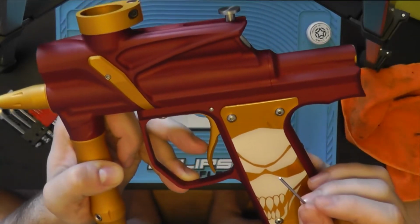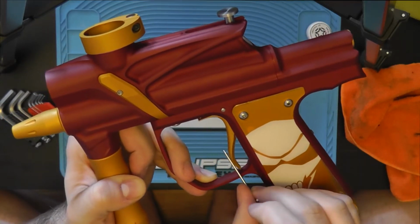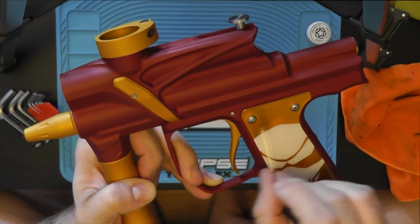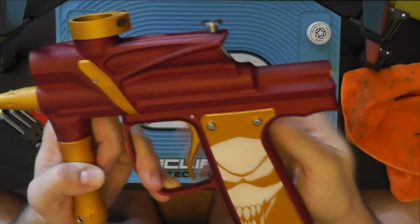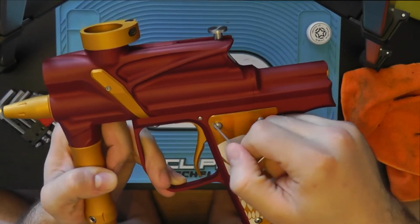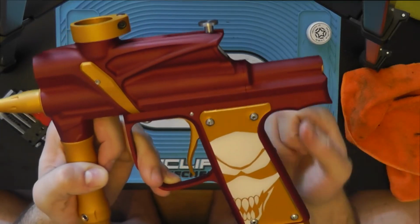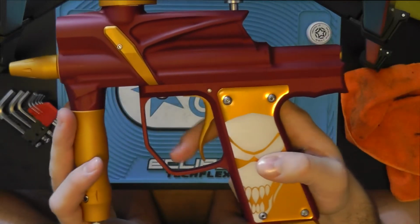So instead of you having the long pull, there's actually a good amount of pull movement and travel here, so it has to crush down that spring a lot more. But when it's up here, it has this little corner piece. So when you press it, the corner actually isn't moving that much in comparison to way out here, because it's so much closer to the leverage point.